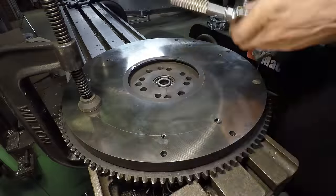Next up, the pressure plate, a brand new pressure plate, will bolt right on here to the flywheel. And at this point now, it's not a Jaguar anymore. It's a flathead Ford. And what I could do now is just go online to Speedway or something and buy an aftermarket adapter kit to go from a Ford V8 to the T5 transmission, because lots of people do that. There's lots of aftermarket support for that. But what fun is that, right?